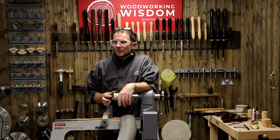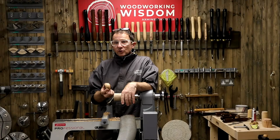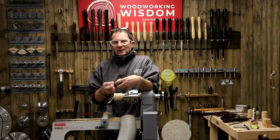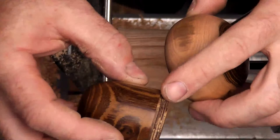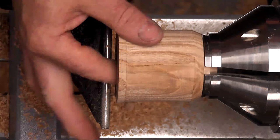A question from Maria - she's asking are you cutting the female thread first? We're going to do the internal thread first. Maria, I know you haven't been well - nice to have you back in. The reason we do the internal thread first is it's supposed to be the harder one to cut and get right. It's more difficult to adjust to fit the male thread. Whereas the external thread I can re-cut and adjust - it's more accessible and easier to get to. So I'm going to do the internal first. It's just making it easier to do the task.